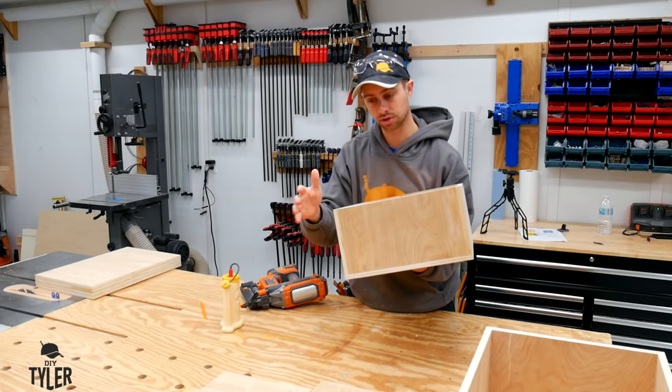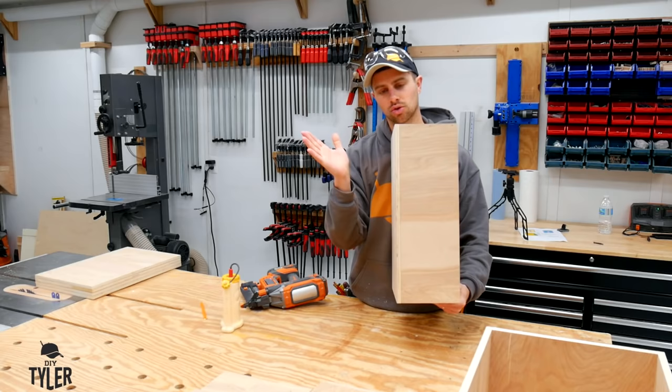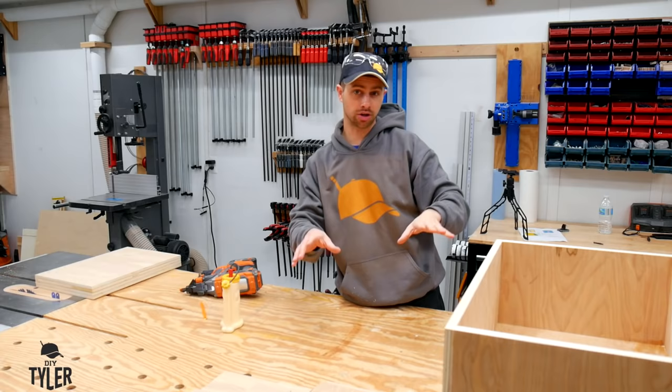In my case, I'm putting the sides on the outside of the front and back. That is because everything will be hidden when we put the drawer front on there and it will look very nice. And the bottoms are just glued and brad nailed right to the bottom. I've had no trouble with assembling drawers like this with hundreds of pounds inside them. Yes, you see the plies on the side when you pull open the drawer, but it's definitely easier to assemble this way than going on the inside. I want to pay attention to my glue squeeze out because I am just going to be clear coating these and not painting them with a color.